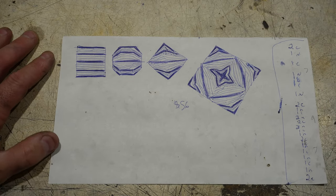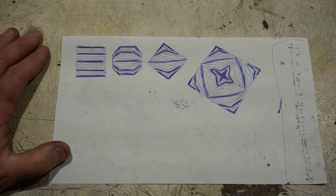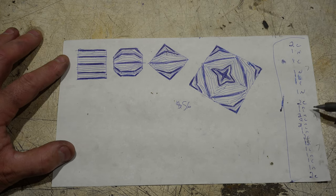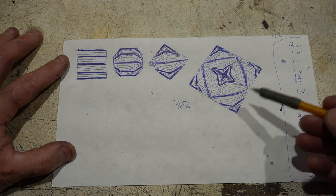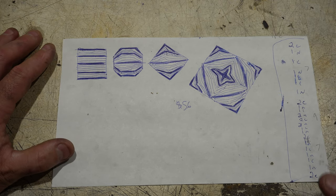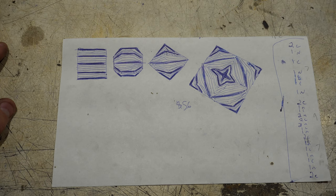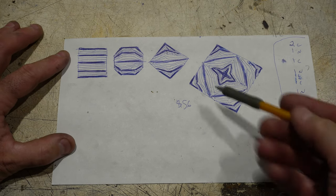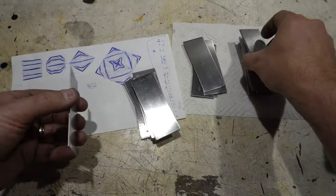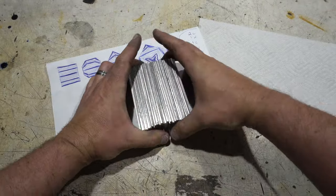Let's talk about the Damascus pattern for this knife. I'm going to go with something kind of bold — not a ton of layers. Total layers is 23, but a couple of these are doubled-up layers which is going to give us our mosaic. If you're curious on how to do mosaic, I'll put a link in the corner to a video I just released about intro to mosaic Damascus. One key to mosaic Damascus is that there are different thicknesses of layers, and that's what gives you your pattern. So I had to be really careful in setting up the billet for this.